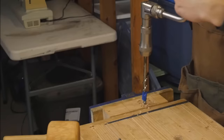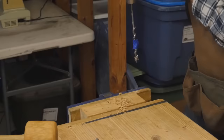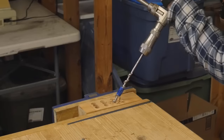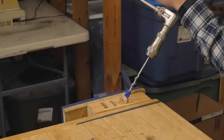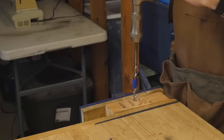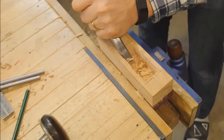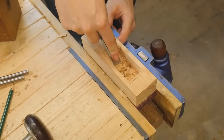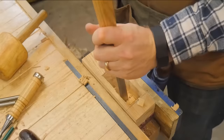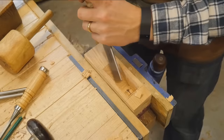And now for the boring part — yeah, it's a lot of this. I drill out all the holes just to make it a little easier for removing the waste with a chisel. I put about a dozen or so holes in the top. You'll notice the blue tape on there — it gives me a depth stop so I know if I go straight down from that point, I'm not going to run into anything I need. It's very careful to make sure that you only bore in as far as you absolutely need to. Once all the holes have been drilled and most of the waste is removed, you can go in with a chisel and start to remove things. This is probably the second longest process of the whole job, making sure everything was exact. You just end up having to take small, small chunks with every move and make sure you're not taking off too much. Constantly checking your angles, making sure everything's smooth, flattening things out and removing stuff.